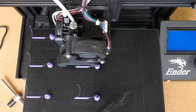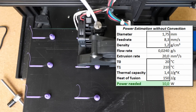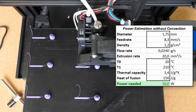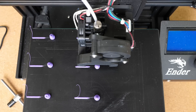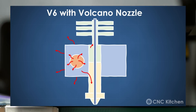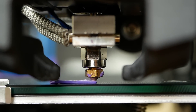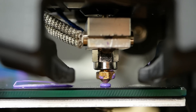Also, if we do the maths, the energy required to melt PLA at 20 mm³/s is only around 10W, which isn't a lot. The 40, 50, or even 60W of your heater cartridge are in many cases easily enough, with the remaining power reserved to compensate mostly the convectional losses from the heater block to the air.